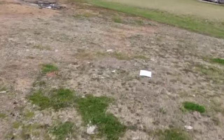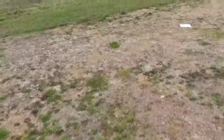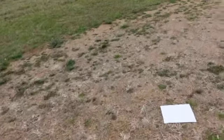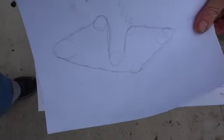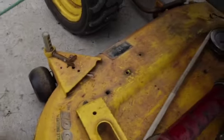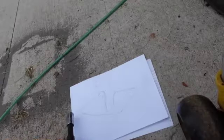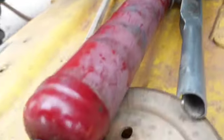There go my papers - that's not good. That's why I lifted up the deck. One of these has the key to it - there it is, that's my drawing. His drawing isn't near as detailed as mine. It don't really tell you everything you need to know. But kind of, I guess it does - not in the detail like this. The belt routing goes: there's the springy one, then that one back over there, then the outboard one, then it goes around that way. That's tough going there. Got everything greased up.